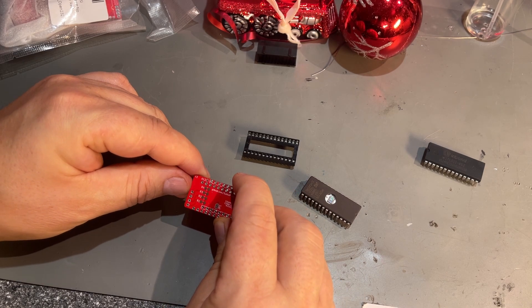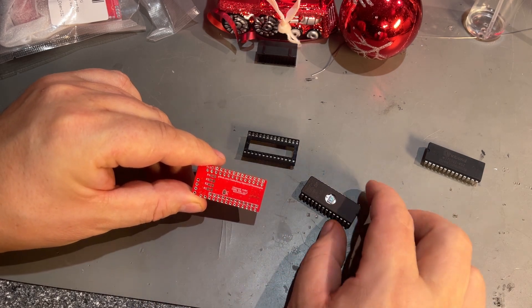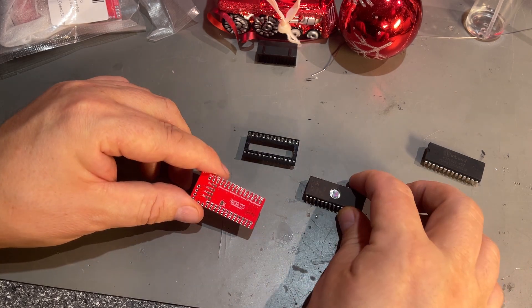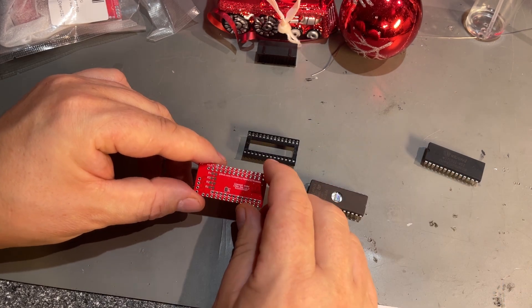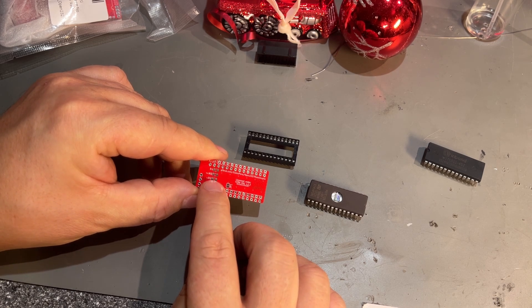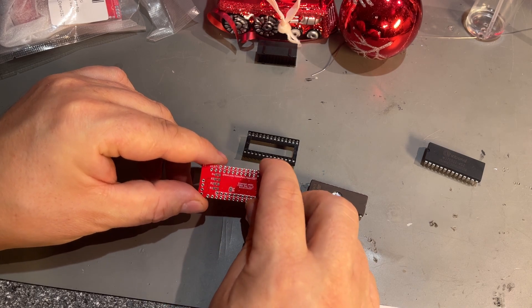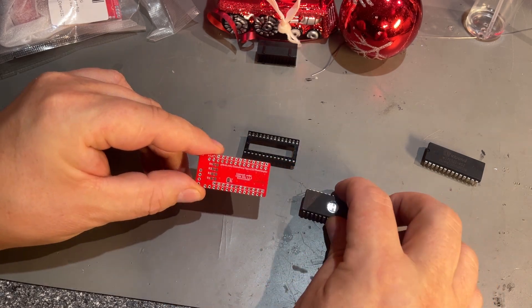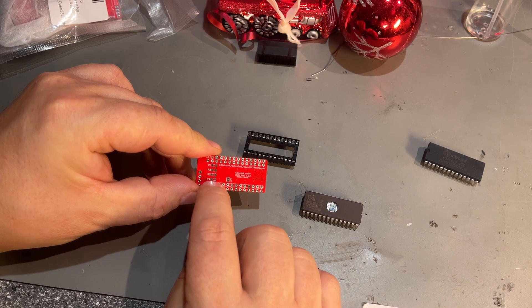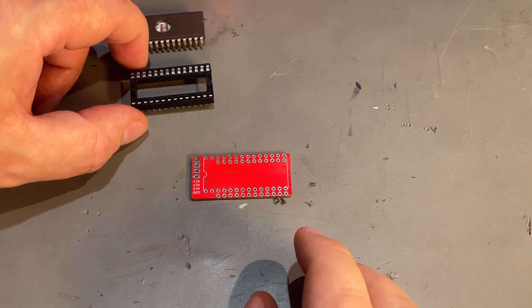With 16K I only need one resistor, because there are address lines you can use to switch between different ROMs on the same chip — so this can hold two ROMs. I don't have an SMD resistor, so I'll use a regular one. It would be hard to fit three resistors, but with this chip you only need one; the other two can just be bridged together.